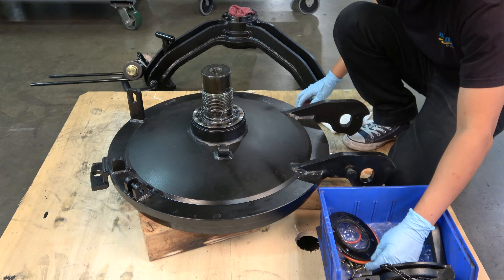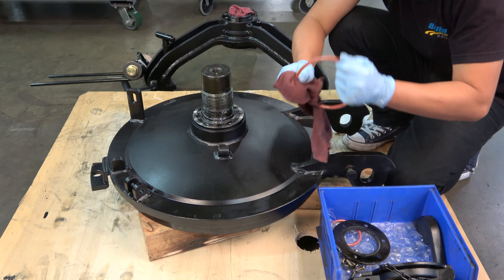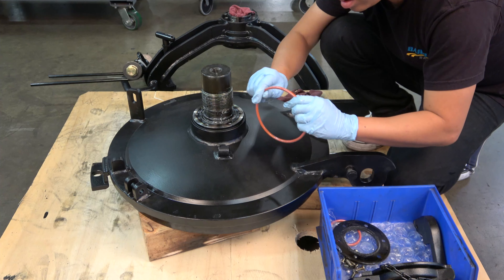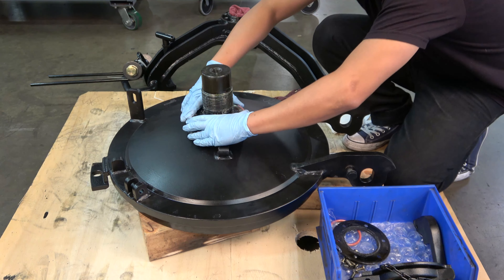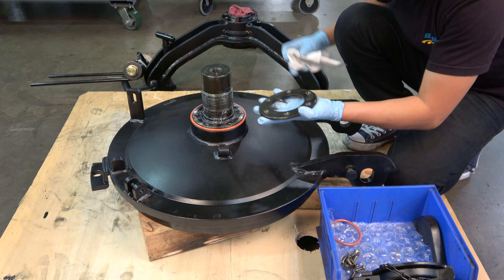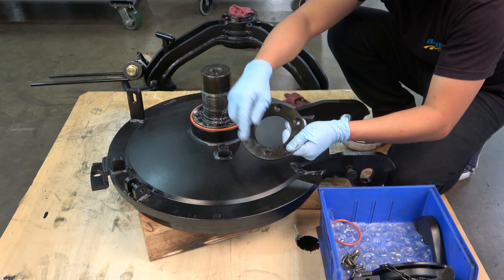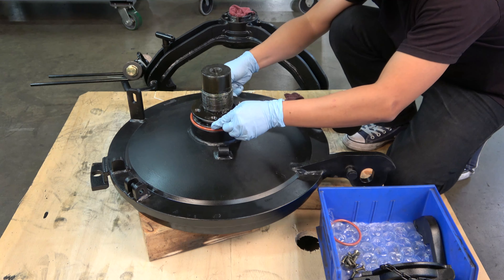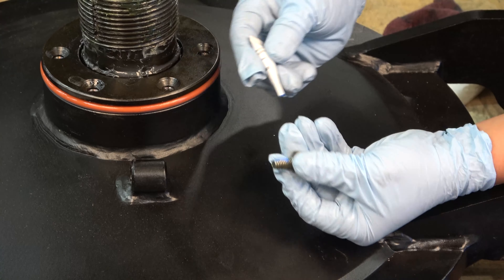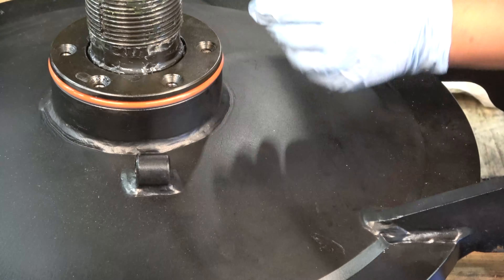Next, reinstall the larger of the two o-rings. Wipe any existing grease from the o-ring and inspect it for any damaged nicks or splits. Place the o-ring over the ram and let it settle into the notch around the cover plate; it should settle in easily. Place the ram retainer over the ram with the countersunk holes on the top side of the ring. Line up the holes and locate six of the hex drive flathead screws. Each of these screws will need to be reinstalled with Loctite 242 — apply a liberal dollop to the threads of each screw and install.